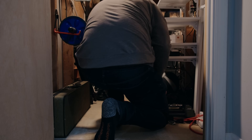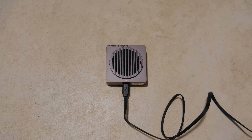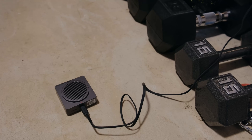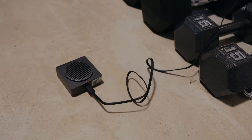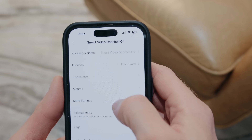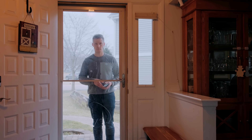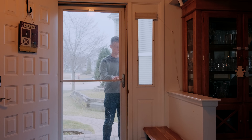If you don't have things known for Wi-Fi interference, like a microwave between the chime box and the doorbell, you should be able to stretch this distance a little further than 16 feet. Just keep an eye under the more settings in the Aqara app to see how your signal quality is doing. In order to replace your home's doorbell chime, the chime box needs to make a doorbell sound, and the speaker on the chime box is 95 decibels — audible through my house just as well as any standard chime. You can also change the ringtone that the Aqara chime makes.